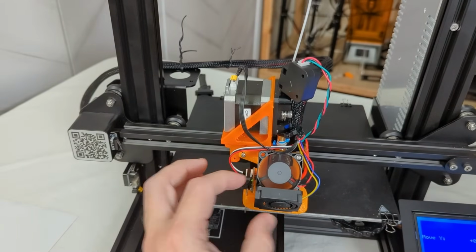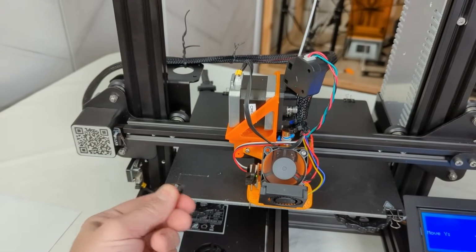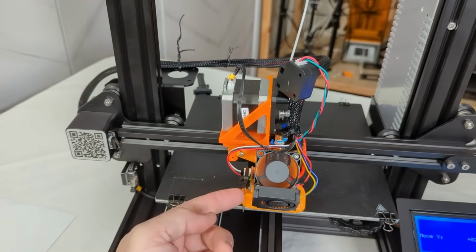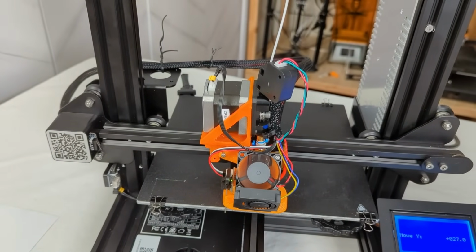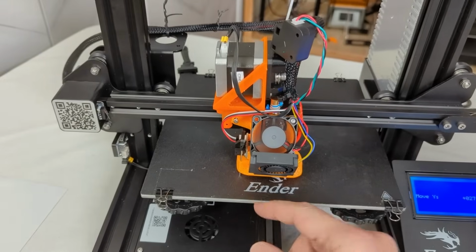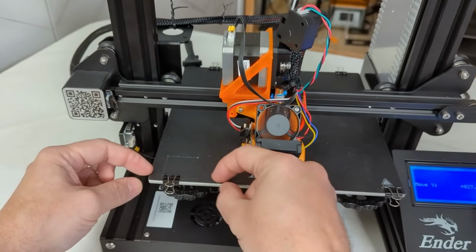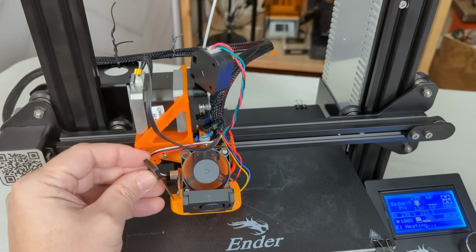So to get from this position to the home position, we're going to get a collision between the pin and the clip here. Shouldn't be too tragic. It will just knock the clip off. This is pretty robust, but it's better to avoid collisions if you can. So the trick there is to kind of violently force the bed out of the way. Typically your stepper motors will be turned off, and so any location that's just not sort of in that little strip will be okay.